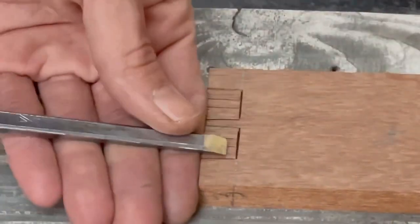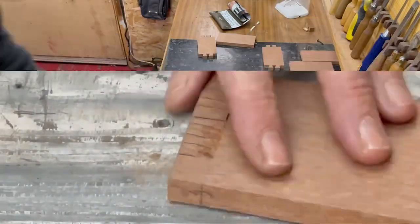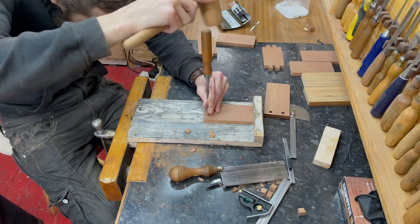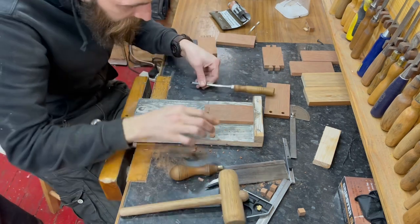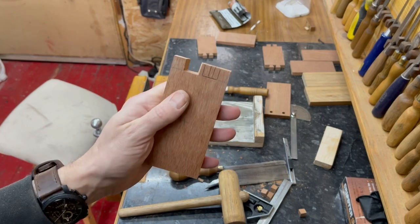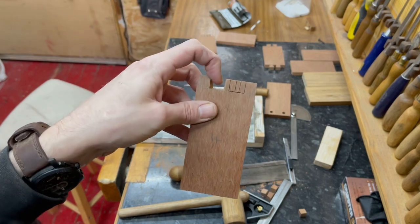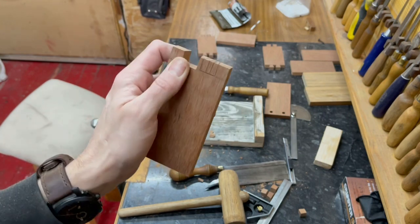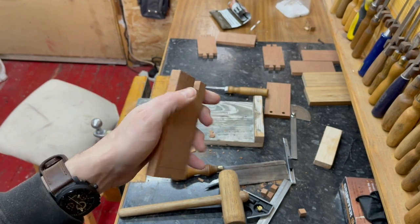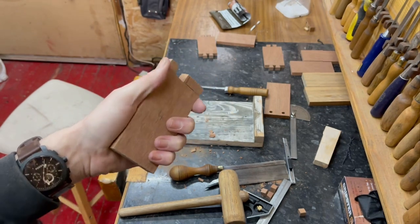We've got another one. Take a wee bit off, hang in at my safe points, and then just chisel it out like this. Got to get a little bit on that side. Right, it's not great, so come back in. And that's us. That's one of them done. It's chiseled all out. A wee high spot there, might be fine, but when we go to dry fit it, we can see all the wee high points and then adjust for them. So I'm going to fire on with the rest, and when it's all cut out, we'll go for the dry fit.